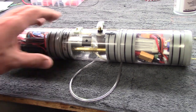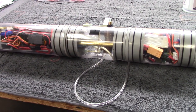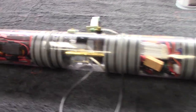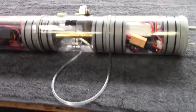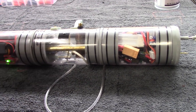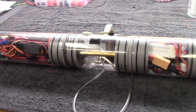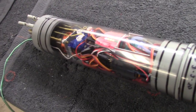Let's test out the emergency backup — that's part of the BLM, battery and link monitor system. It listens for a good signal from the transmitter, and if it doesn't get it — I'm going to turn it off here — you'll see the lights switch immediately. There's a four-second delay, then the gas ballast blows for six seconds, purges the tank, brings the model up to the surface, and in theory gets you back up to radio control. Signal re-established and we are good to go.